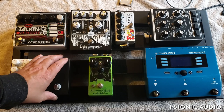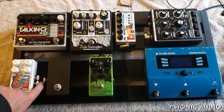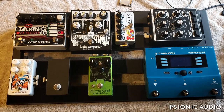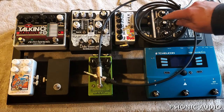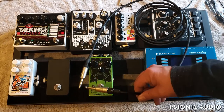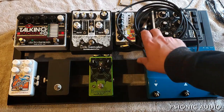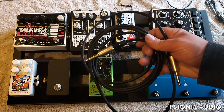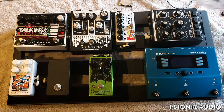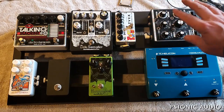All right, tap tempo box in place. This one won't rock back and forth when you step on it like that little bitty one would. All the cable done for that. Shorten the cable to there. Made a cable to go between this and this when this is in use. So you plug the guitar into here and plug this in. It's a between songs kind of thing. But you know, good quality Mogami and Neutrik. Good solder joints. Quite a bit less expensive than if you buy it pre-made. I think better soldering. And then I've got these 6 foot long adapters that go from this plug to this when it's in use. And I'll test that.